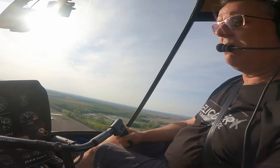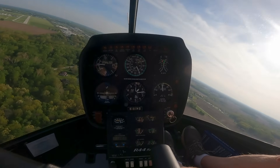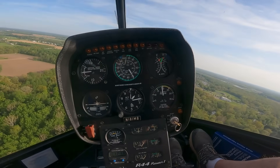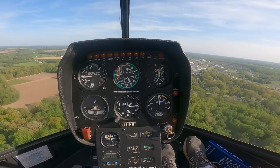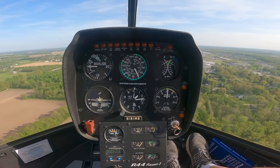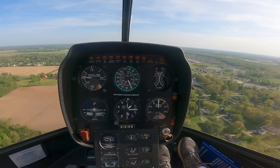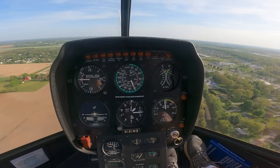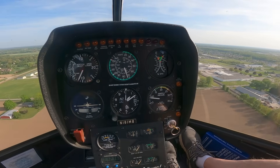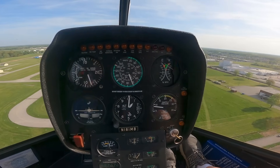There's the clutch light — went out almost right away. There's 70 on the speed. I overshot the runway just a little, but that's okay. Entering with the 18, number's a little bit above the top of the dash. We've got 70, we're at 450, zero rate of descent, we're in trim. One, two, three — enter. Down collective, right pedal, aft cyclic, roll up the throttle. 70 on the speed — looking good, get it in trim. RPM's looking nice.